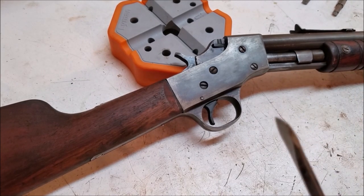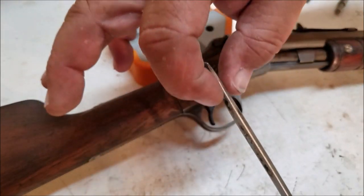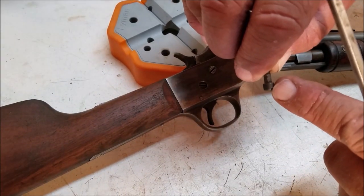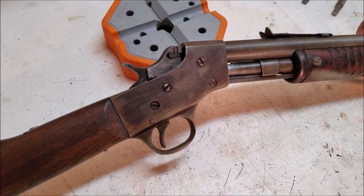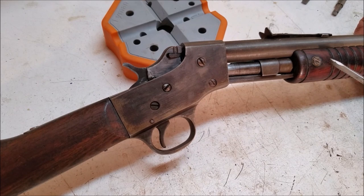Let's see if I can get this in a light here. It tapers on both sides in width. So when you stick it in a screw slot, the screwdriver itself as it goes into the slot only contacts the head of the screw on the corners when you're tightening. And what happens when you tighten it? It buggers the slot — it messes the slot up, it displaces the metal. And if you look at most old guns, you're going to find all kinds of screws that look just like that.